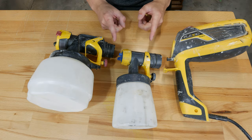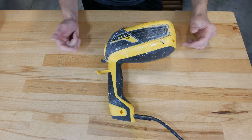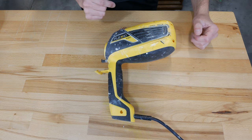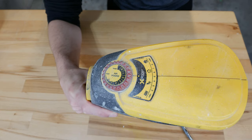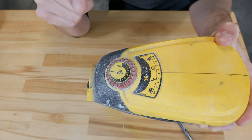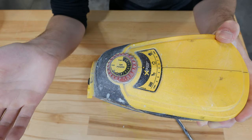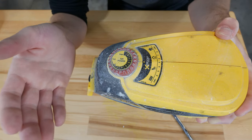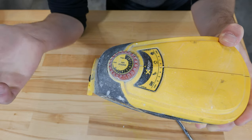These are the three main pieces that came with my Wagner Flexio 590. The main piece is what your nozzles attach onto — air goes in through here and through the turbines, with replaceable filters. The key feature is the X-Boost power dial, which increases and lowers the air pressure coming out of your sprayer. Whenever I use it I keep it around seven, but if I'm trying a new paint product I just spin it until the paint comes out nicely. When I spray furniture with water-based poly it's always on seven, and usually when spraying watered-down paint it's around seven as well.